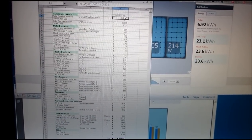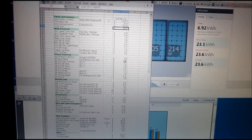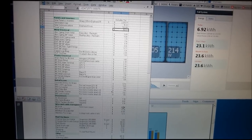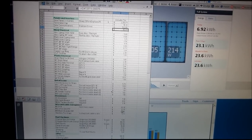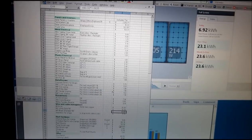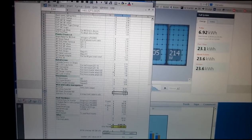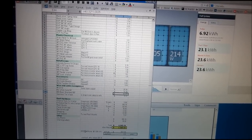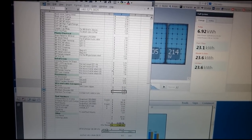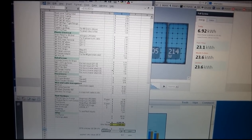Here's the bill of materials and final cost. This includes everything: the panels, the AC bus cable, all the metal electrical boxes and fittings, plastic fittings and conduit, bolts and screws, AC disconnect, breakers for the main panel, all the wire including 8-gauge ground, 12-gauge communications wire, 10-gauge, all the roof hardware, rails, flashing, roof sealant, city permits, and warning labels. Total comes out to $4,000. After rebates: $2,590. Assuming 2,000 kilowatt hours per year at 32 cents — the high tier 3 and tier 4 California rates — I'll be saving $663 each year. Payback is 4 years.